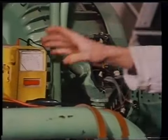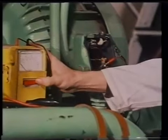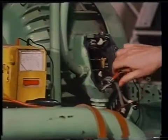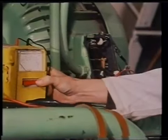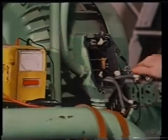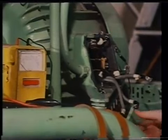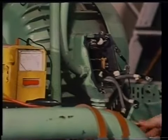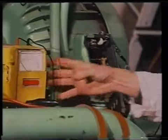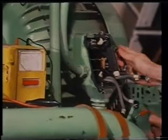First, the terminals to earth are checked. The phase windings have been separated electrically from all other parts of the motor. They can be tested separately to earth. We've now tested each and every separate electrical component in the circuit on the load side of the starter. These techniques, in some combination, will be used to trace an evasive fault.